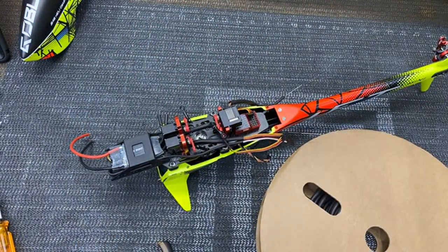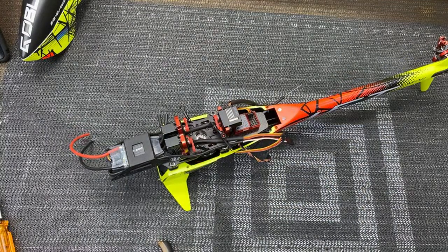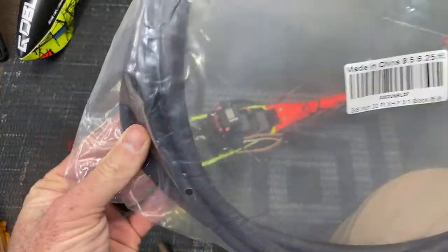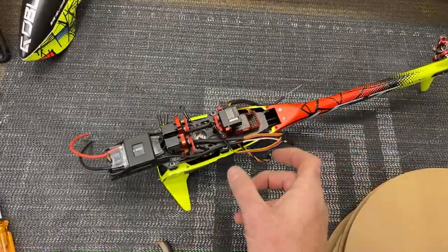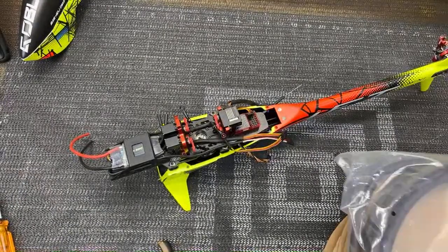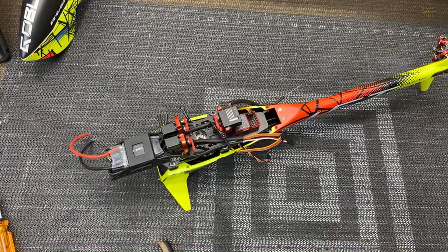Nice build. Yeah, and then I buy 1/2 inch. I buy 3/8. I do have this stuff, which is 3/8, 3-in-1 with the glue in it, and I'll use this for junction pieces, but I won't use it often because if you have to cut it back apart, this stuff sucks to cut back apart. That glue really holds.